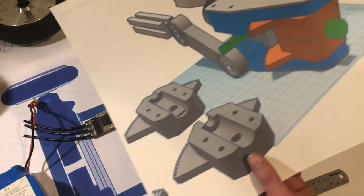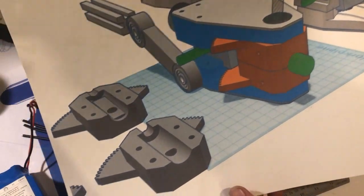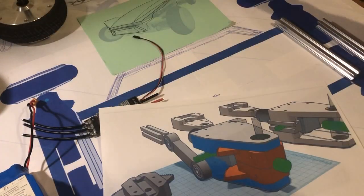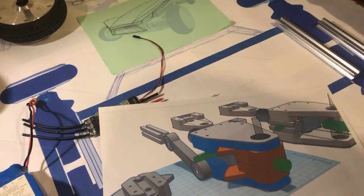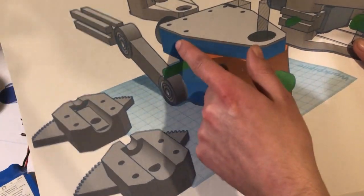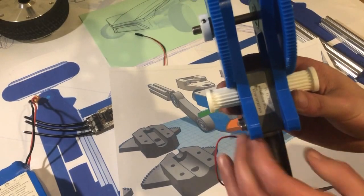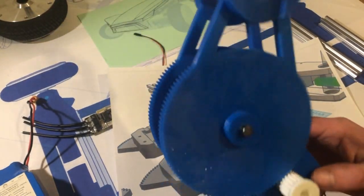This is one of the things that we need — the wheel hub mount. It's got these two parts here which close together and clamp around the hoverboard wheel shaft, and then those two pieces are attached to the motor bracket. This is the same kind of motor that we're going to be using for the steering, except it's currently used for a robot arm.